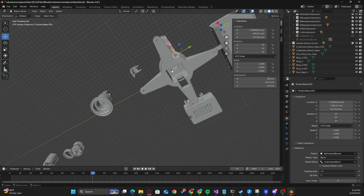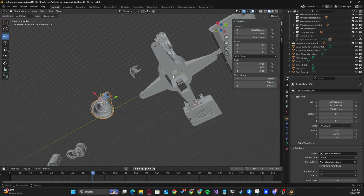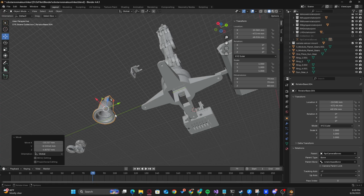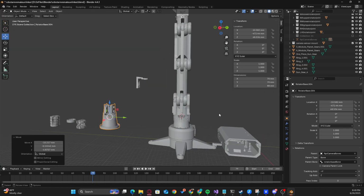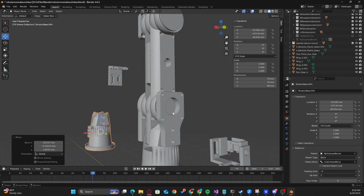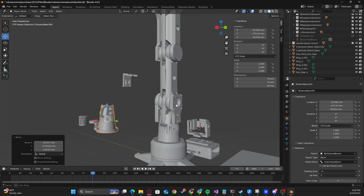The 3 planetary gear goes inside the Lazy Susan middle part, which is first you put it on the motor, because that really fits on the motor. And then of course you screw the motor in, you put the gear in, and then you slide this on top of it. But make sure to put the bearings below these ridges and above those ridges. So yeah. Then of course the 4-layer planetary gear goes on all the joints above that.